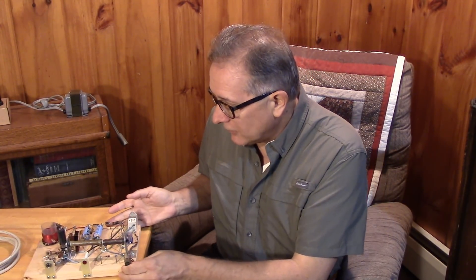Sometimes you do get a shock now and then. Somebody asked me, Mike, how many times have you been shocked? I've been playing with radio stuff since I was a kid, because I had a TV repair guy as an uncle who gave me things he probably shouldn't have. If you average out the number of high-voltage shocks I've had over my career, I'd have to be pushing 100. But by far, the worst shocks I've gotten have not been high-voltage shocks — they've been the voltage between the line and neutral, or line and ground. Just because something's only 117 volts, or 120 volts, or 230 volts, that doesn't mean it can't give you the worst shock of your life.